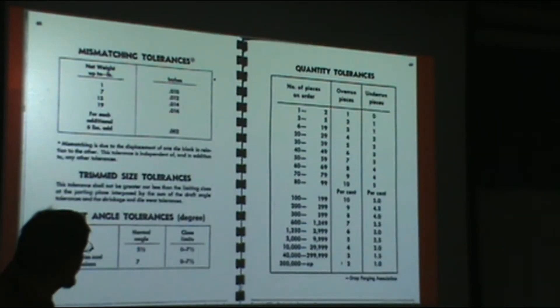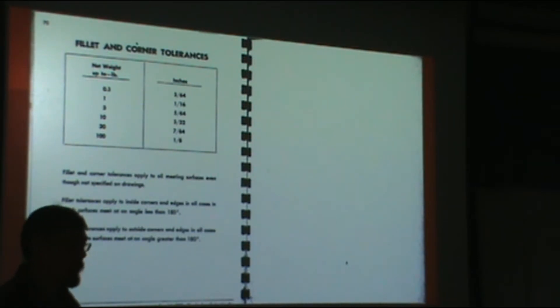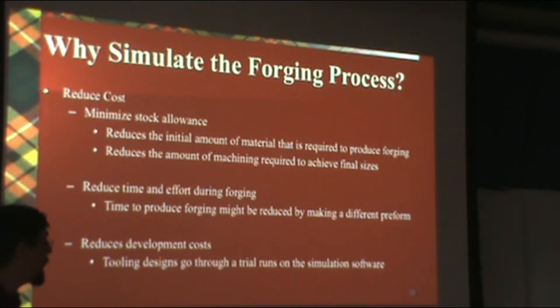That's pretty much the closed die process as it was done in the 1950s, and it's still done that way in many places. But we use computers to simulate things, and we certainly do that at Scott Forge when we do closed die or semi closed die type processes. Simulating lets us do all the work on the computer before we invest money in metal and machining to make tools. We can also figure out where it's possible to get closer tolerances. In the last probably 10 years we've really begun to rely heavily on simulation tools.